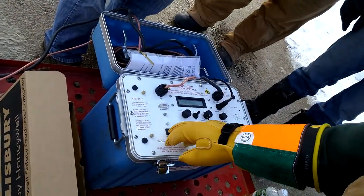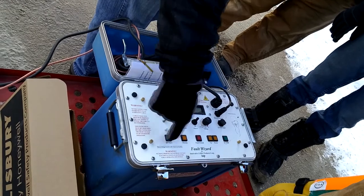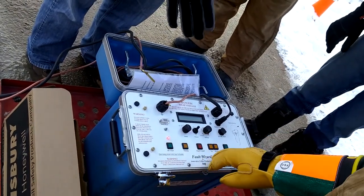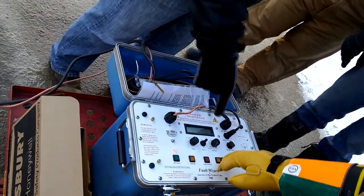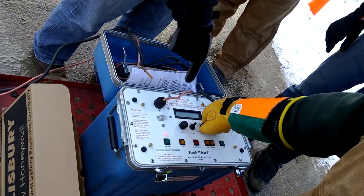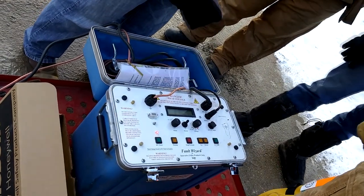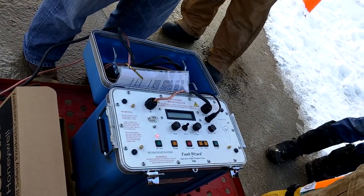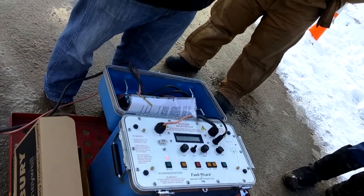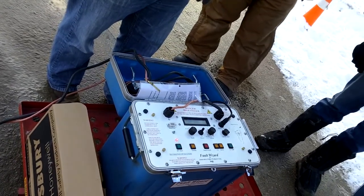Go ahead and hit HV start now. Keep in mind — if you had the output up and hit stop ground before returning to zero, it's not going to do anything. So return it to zero first, then hit start. The red light comes on so you know it's live. Go ahead and turn it up. Normally we'll go ahead and turn it to 10 kV because that will give you a good pop. When the capacitance builds up and matches that 10 kV reading, you can hear it popping. It takes about four seconds to get up to 10 kV.